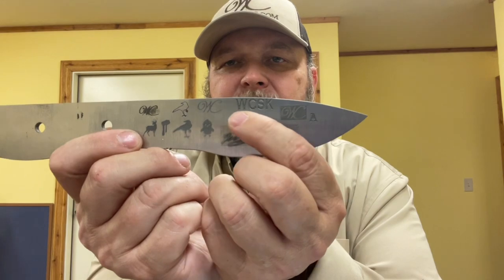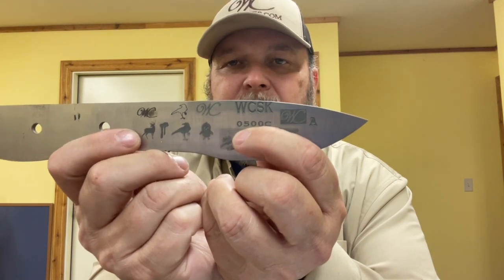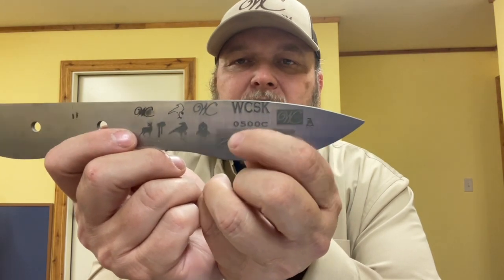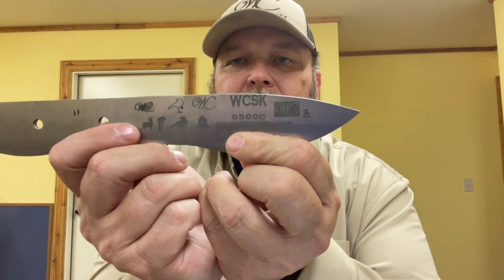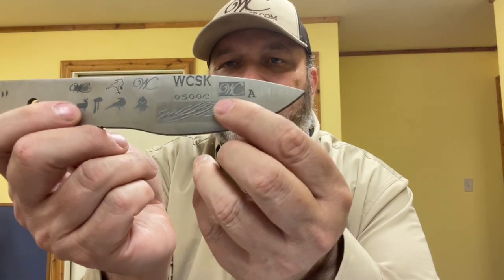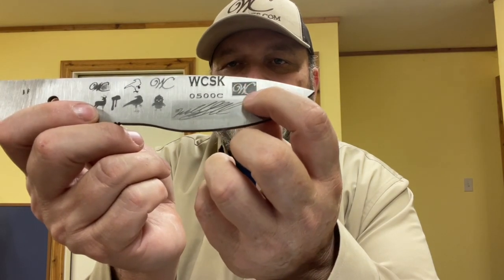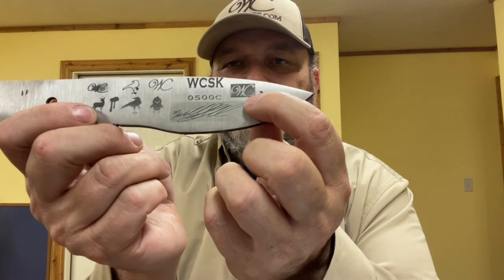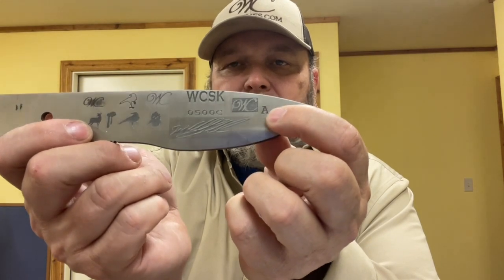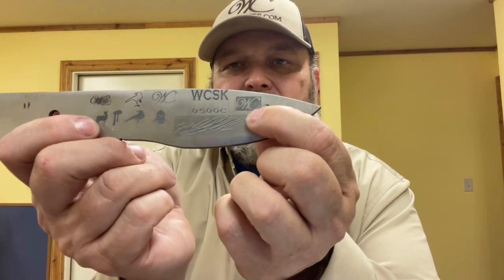So I mean, just the WC, it's more uniform. The serial numbering, I can do it a little bit plainer. Sometimes with the marking before heat treat, the serial numbers were a little illegible, but now I can get them cleaner and brighter and just do a better look. Even the prototype, which is the reverse of the logo, it cuts and leaves a raised area instead of cutting in the steel, and cuts around the WC. So that would be the prototype stamp or laser etch with a model number, like prototype A, prototype B, prototype C, like before. Instead of the shadow stamp, it's got this.